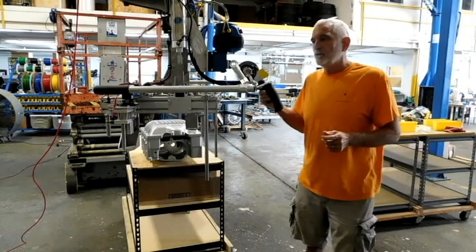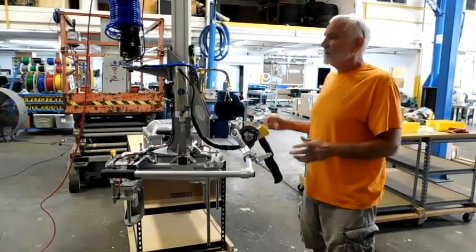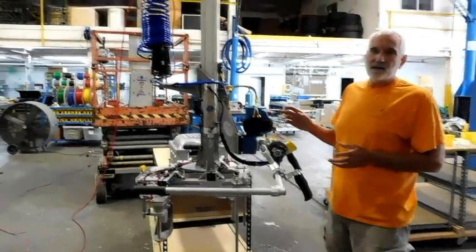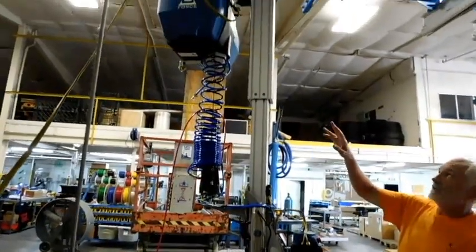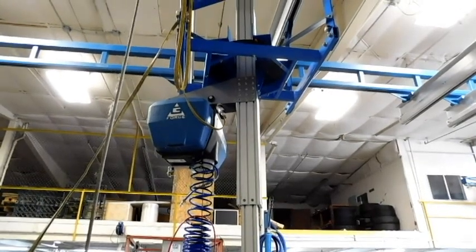For the system, we are going to use a rigid mass manipulator, telescopic aluminum mast, using a Gorbel IQ G-Force in a nested trolley configuration on a double aluminum bridge Gorbel system.